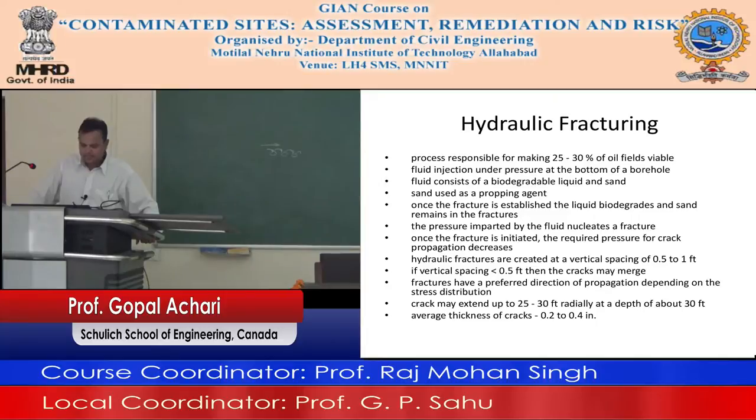Cracks may extend up to 25 to 30 feet radially at a depth of about 30 feet. An average crack. One of the other differences between hydraulic and pneumatic is the crack thickness, the thickness of the hole. It's about 0.2 to 0.4 of an inch. Compare that to pneumatic. It's much smaller.